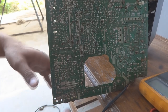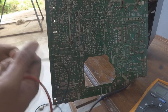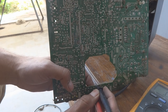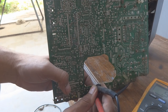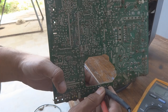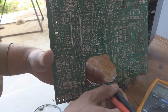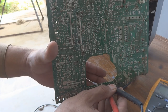It is easy to check these switches. We grab our multimeter and put it on the continuity setting, listening for continuity while pressing the switch. I am going to press on one switch — it is giving a response, but very tight. The other switch I check is also the same way, but easier pressing. They are not accepting a gentle press; they are not going to respond to a gentle press.